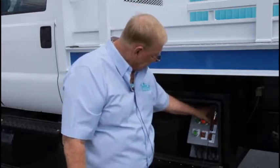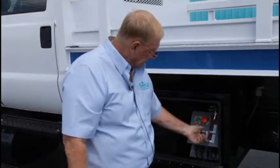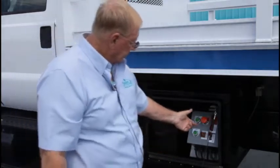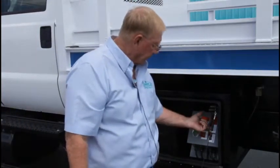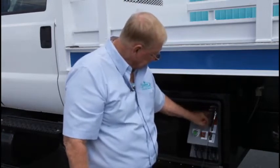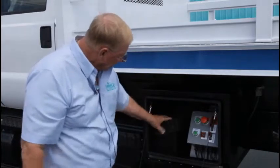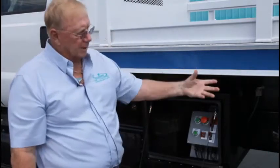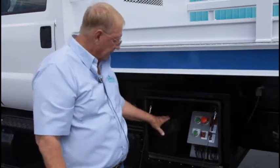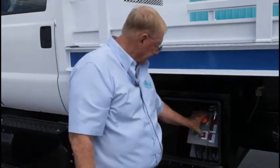This is an e-pump. Let me cut this noise down for one moment. This is your interlock for the outriggers. This is your control for upper controls from the top. And this is your e-pump control. Okay, so this is also a backup battery for the e-pump. Should the engine lose its power, you have an e-pump to operate. So we'll go back to starting all over again.